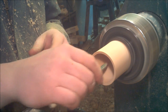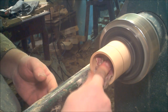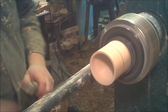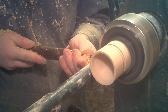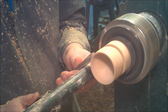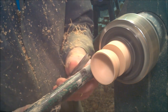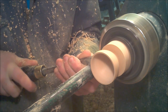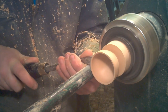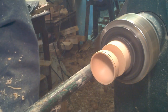Here comes the pencil — it's green. The end is measured. Make sure to leave about as much wood on the left side of the pencil mark as I would be facing towards the chuck, and you'll see why in just a little bit. Parting tool sets up for some skew work to define the front rim, and a handful of cuts is often all it takes to make a very reasonable bowl. You can take a lot more time on this and make a much more balanced piece, or you can shoot to make a basket full. Customers haven't complained when they see a basket full of these — they just pick the ones they want. This can be a very productive piece if you work quickly.